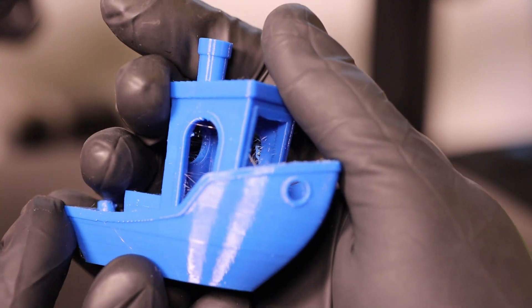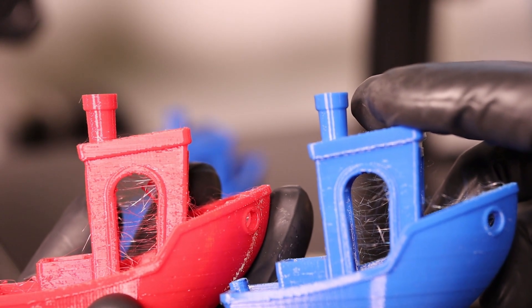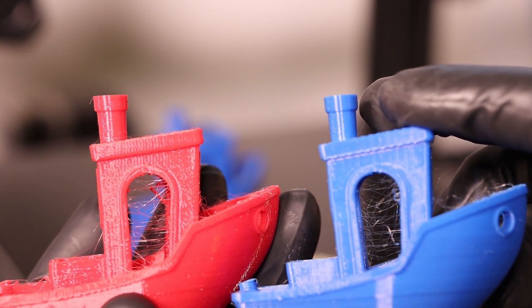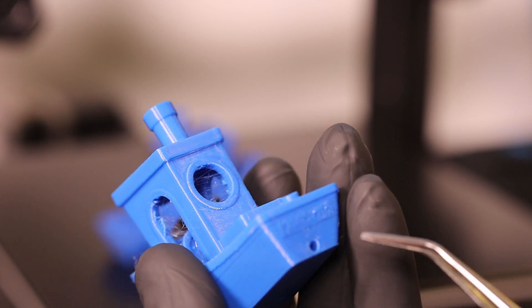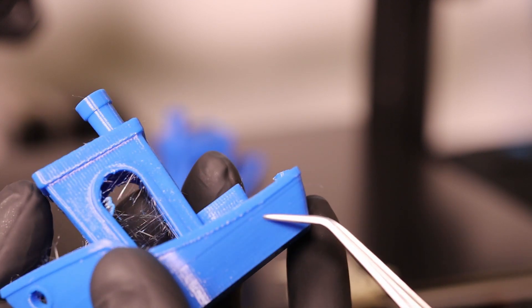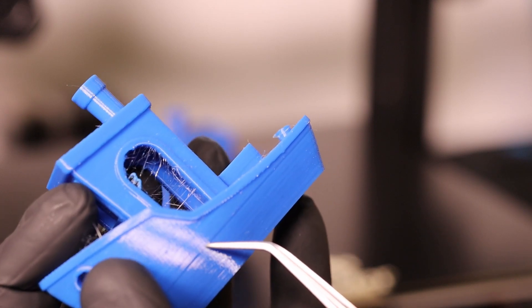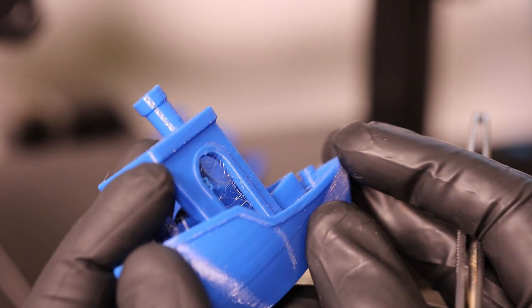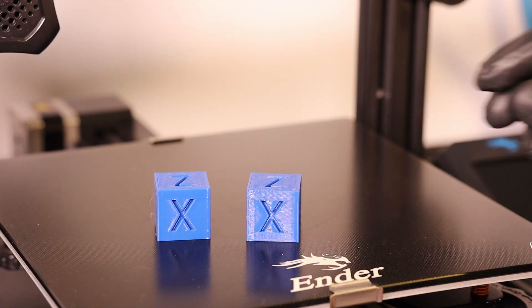Because the pattern is so repetitive, it might be caused by worn belts. At this point I've only replaced the Bowden tube, extruder, and springs on this printer. There is also a visible transition line on all of the Benchy prints about 12 millimeters up — this might be directly in the G-code, as transitions in the shape of the print itself can sometimes cause these. The XYZ blocks look really good.